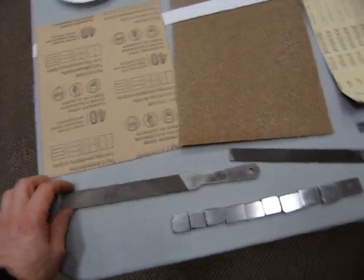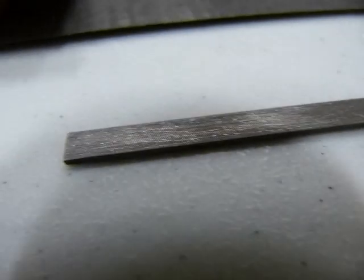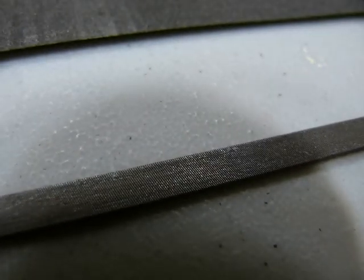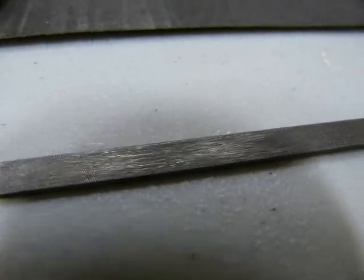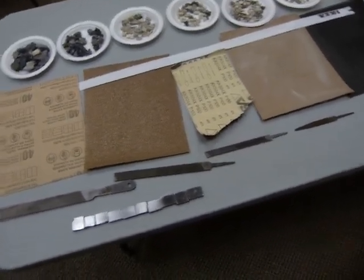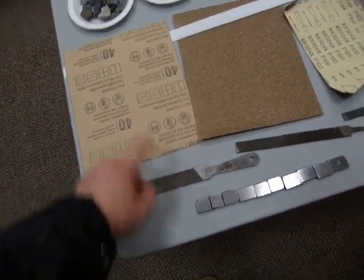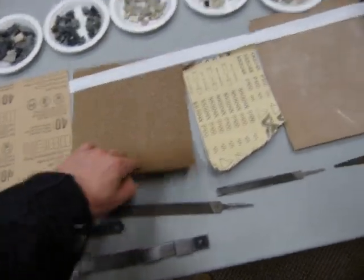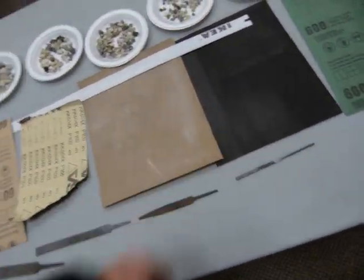It's very similar to the concept with files. This one is an 8-inch file, a 7-inch, a 6-inch, a 4-inch, and a needle file. The teeth on the shortest file are the smallest as well. Hand files don't have grit numbers, but you can compare tooth size: an 8-inch file corresponds to approximately 60 grit sandpaper, then 100, 120, and 220 as the files get smaller.